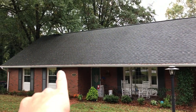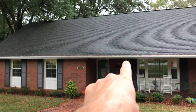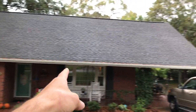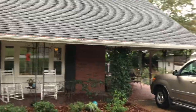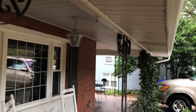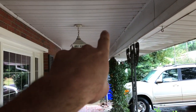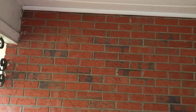The attic renovation we've already done was on this side of the house — from the end to the French doors, just past the front door itself. This side has yet to be renovated. The carport and all the porch is cantilevered, so the knee wall actually runs right here above this brick exterior wall, and all this would be behind the knee wall. On this side of the house, the knee wall is there, and that area actually has house beneath it.